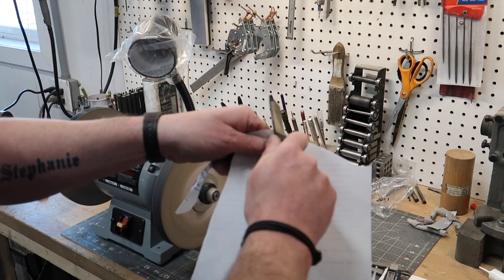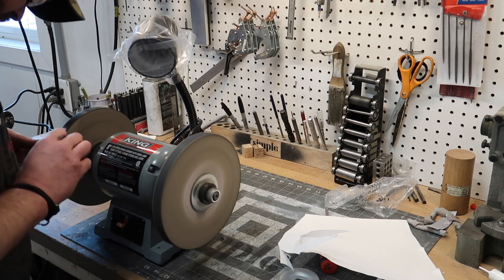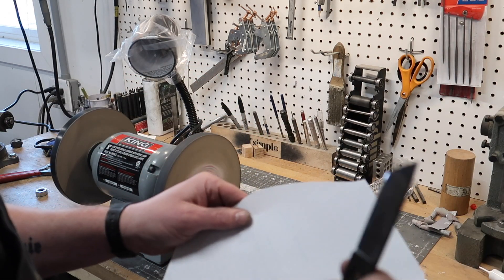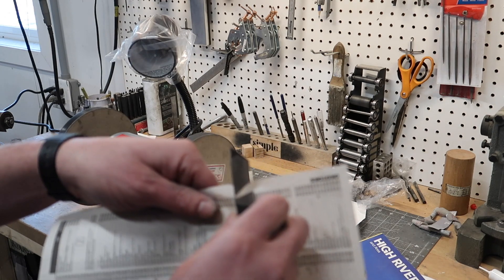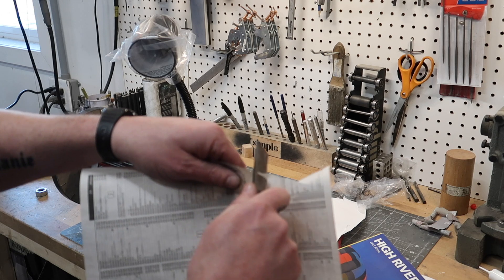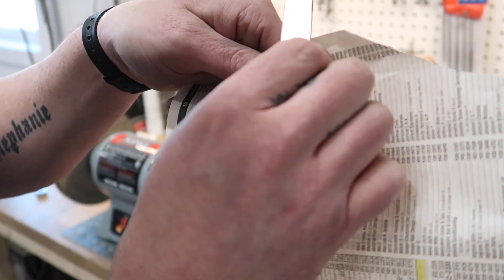Much nicer cutting action. It definitely stays much, much cooler — I love it. This is a nice utility cutting edge — it was twenty-thousandths of an inch. Not sure if we're ready for a paper test, but let's have a look. It's cutting well with just a little hang-up right there. The paper test shows not just how sharp the knife is, but whether it's consistently sharp along the whole blade — you want it to cut from the back all the way to the tip. And you can see it cuts very similarly the whole length of that blade.